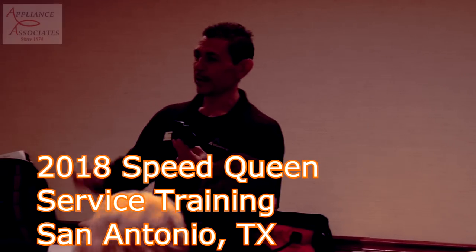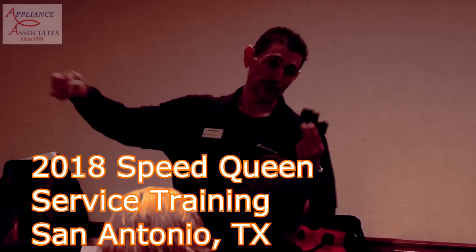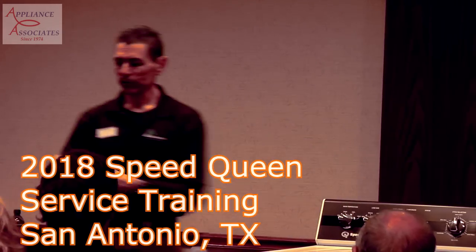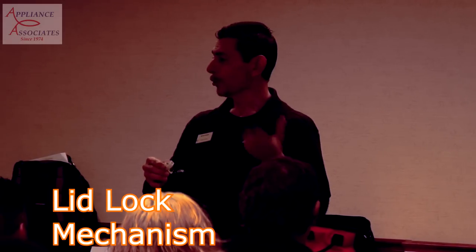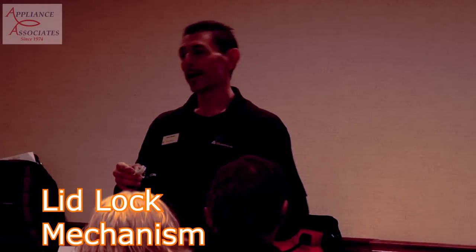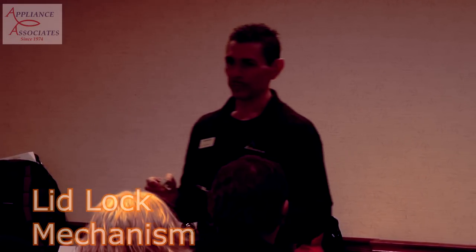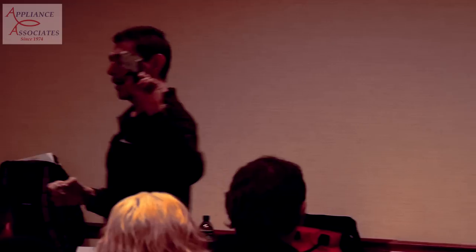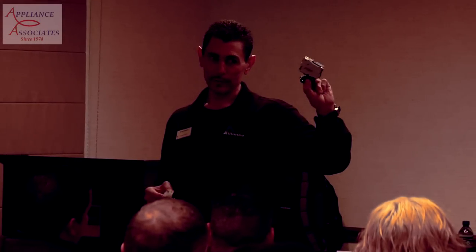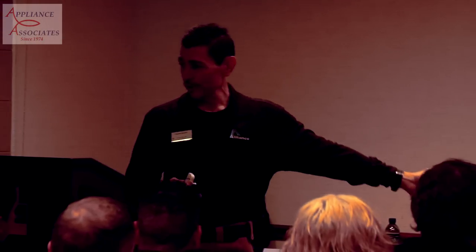It swells and it locks the strike, which is on the lid. It locks the strike within the switch. When you take current off, it then releases and it cools and it changes back to regular position. The one I'm going to send around is 240 volt. This is for an export model. The one that comes with the machine is 120.